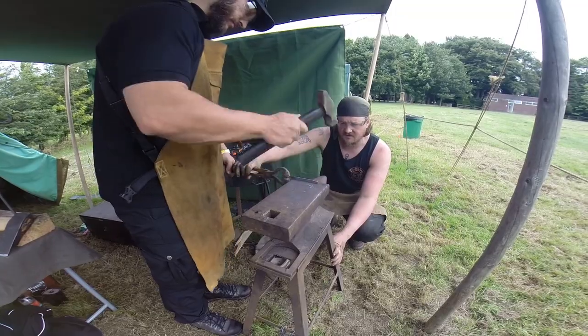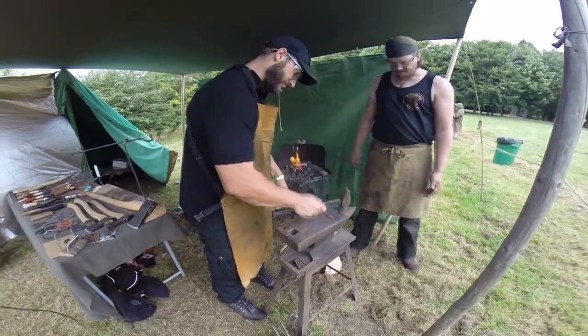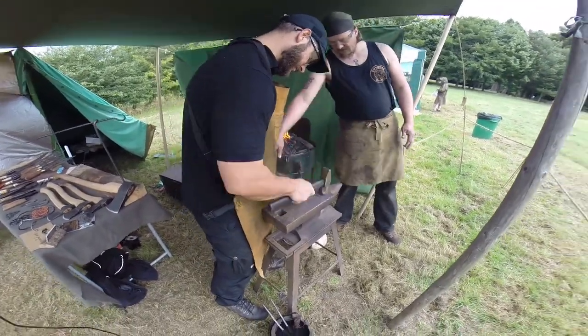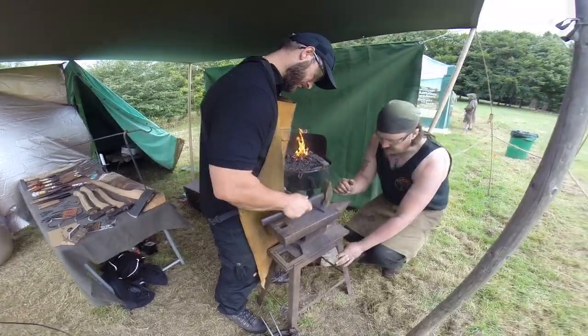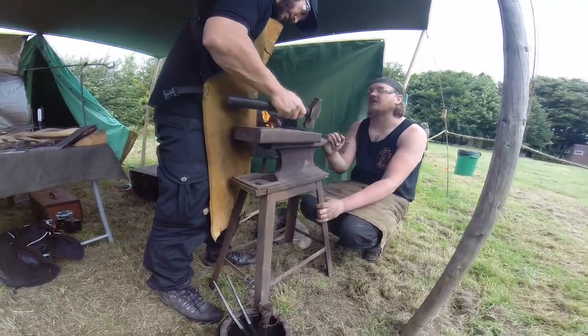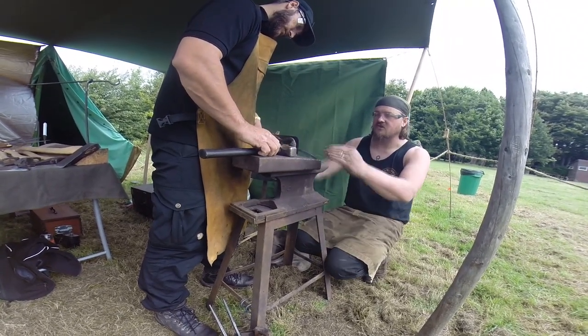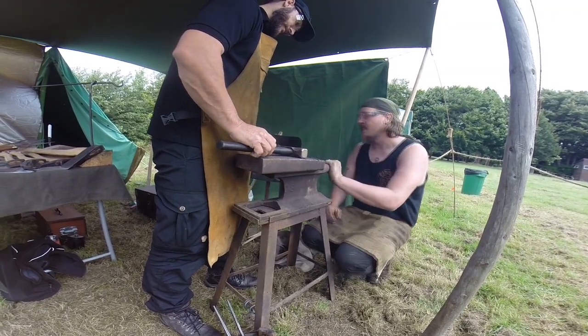Now you get the other hit of the hits. Back it. Good. Turn. Step forward. Again, and then there we go. Good. But you start to hit back here, you get the end down. Think of it like a tube of toothpaste. You can overlap the hammer and the edge of the anvil, come in there, and that'll squeeze it to a point quick. Think of it like a tube.